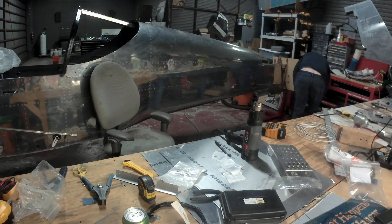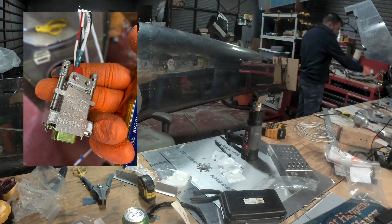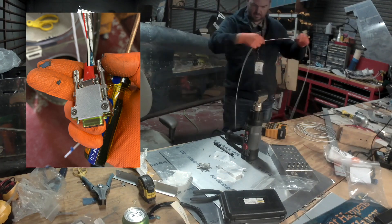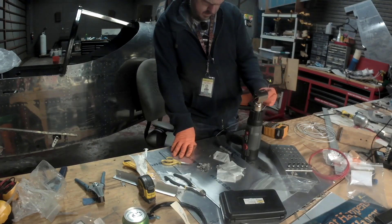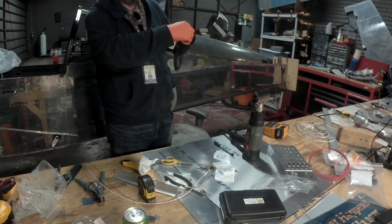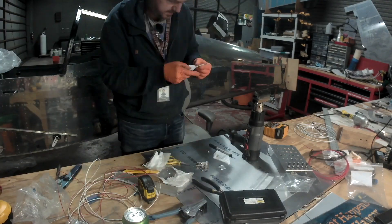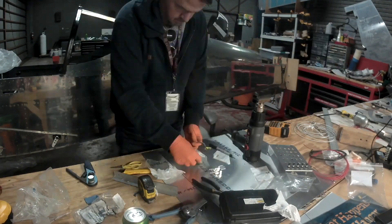Here's a picture of the connector assembly. The CAN bus shielding gets grounded at every Garmin box — you take the shield, put a ring terminal on it, and connect it to the back shell. For that you need number 8-32 screws, five-sixteenths inch. Unfortunately those don't come with the connector kit, so I've ordered a bunch. That's the only thing left to properly connect the ground.